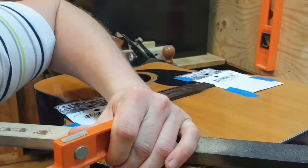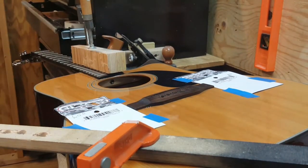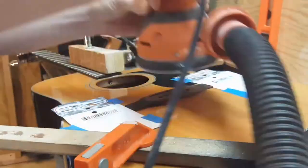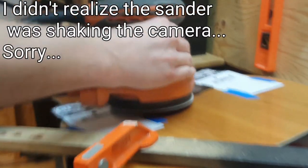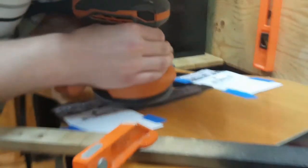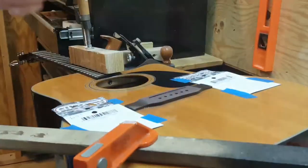I've got a couple pieces of thick paper — almost like cardboard but a little thinner — laying down there just to protect the guitar top in case the sander moves a bit too far. I'm starting out with 80 grit sandpaper and just going to town. I do want to keep the shape — you want to keep the back of the bridge lower than the front, because you can have issues later when you go to string the guitar if the back is higher than the front.